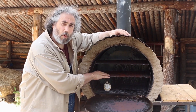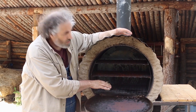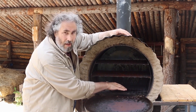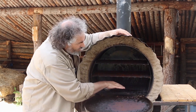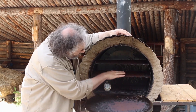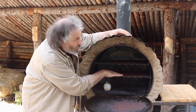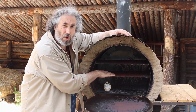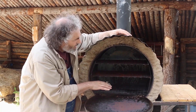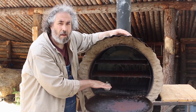What we want to do with these racks is get a little bit of oil on them, and that will create a seasoning layer, kind of like what you have on a cast iron skillet. You can see that the parts of the rack that have some oil on them are not rusting, while the racks without as much oil are starting to rust. So we're going to take that rust off and re-season them with a bit of oil to get a nice set of racks that will last decades.